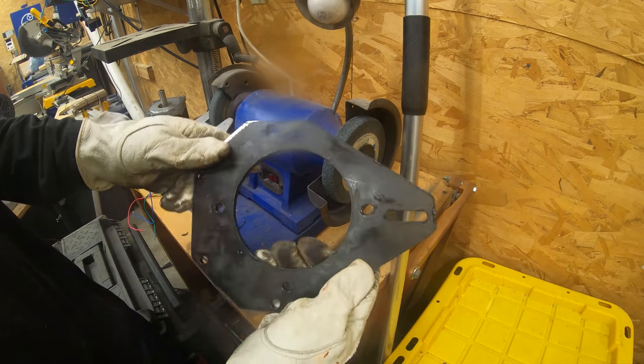I don't want to get excited too early, but I think it's working. There are a few features I need to add to make this totally awesome. Number one, I'm going to cover up the belt — you're supposed to guard those moving parts. And I'm going to add a potentiometer right here in front with a 3D-printed mount, so I can adjust the speed and then reach out, grab the handle, and pull the trigger to start the VFD.